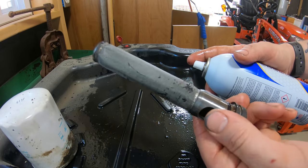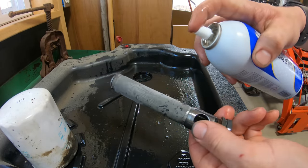Mine looks like it did on the first oil change because of all the hydraulic attachments I've added, all the times I've been into the plumbing, and being overdue on top of being worked very hard. I'm really happy it wasn't fully clogged because that means I wasn't starving the pump too badly. If this gets totally clogged, you'll start to starve your hydraulic pump of fluid and burn your pump out — that's why it's very important to keep this clean.